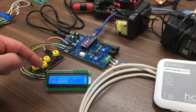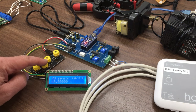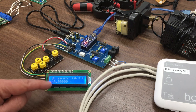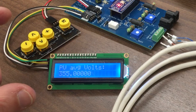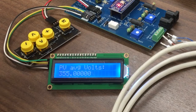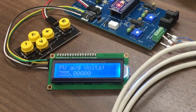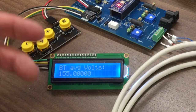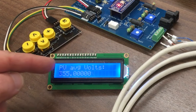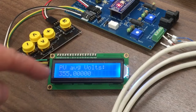The same calibration value exists for the battery channel. Next you can set what I've called the average volts. Because I've got two strings in series, this is the average of the two string voltages — if one's a bit higher and one's a bit lower, you pick the average and the math still works because you're putting the CT clamp around both positive cables going into the inverter. Similarly, you enter the battery pack voltage — it does vary a bit, but typically once the sun's bright enough and the panels are at around 85% of their voltage, current starts flowing.